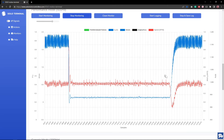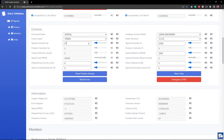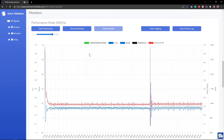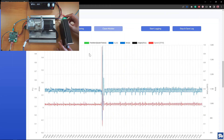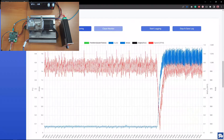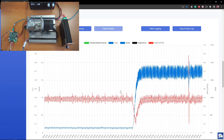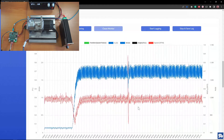You can reduce this speed dip by increasing your speed controller gains. Going back to no-load condition, if I increase KP to 0.15 and then turn on the load, you see the speed still reduces, but this time the minimum value is 923 RPM instead of the previous 900 RPM — so it's a bit better. However, increasing KP has its own consequences. Overall, we successfully tested various conditions: increased load, decreased load — and the speed remained the same.